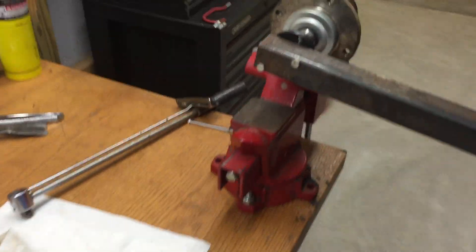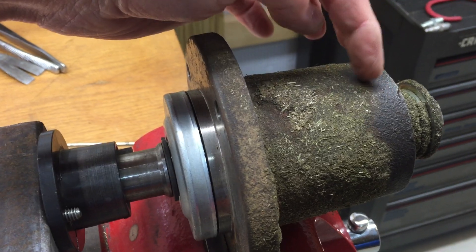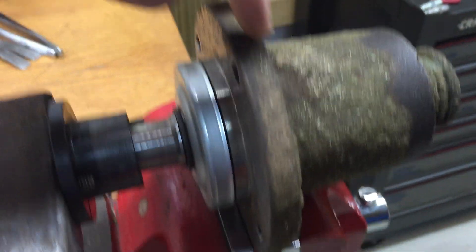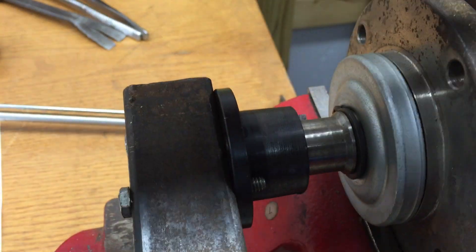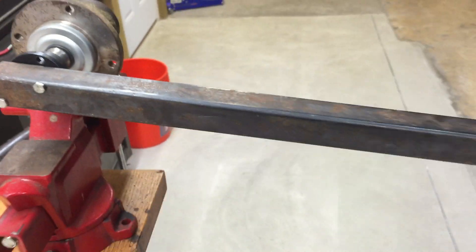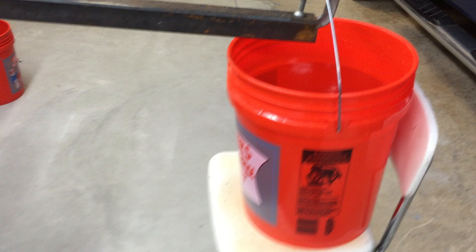To check the calibration, this is where a neat invention comes in. I've taken an old lawnmower spindle — it has a deep groove ball bearing up here and one deep groove ball bearing here. Here's my 15/16th nut that I'm going to torque on. I'm holding it in a vise and I've attached a taper bushing — which used to hold the pulley to the drive spindle — now used to attach this bar, which is my lever arm at 31 inches center to center.